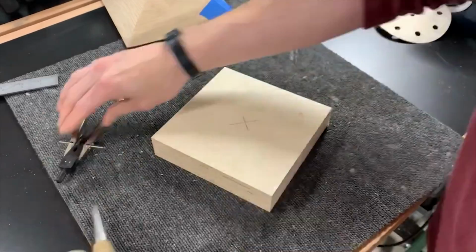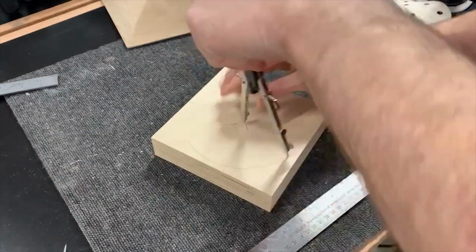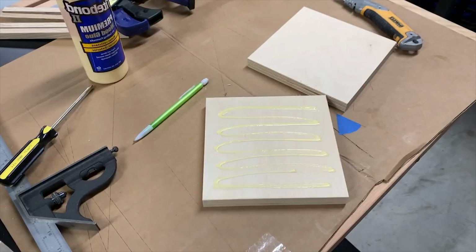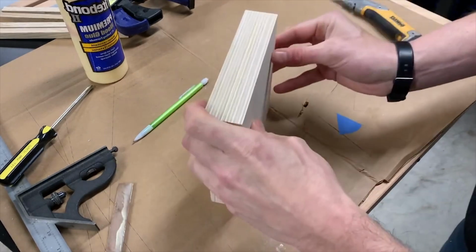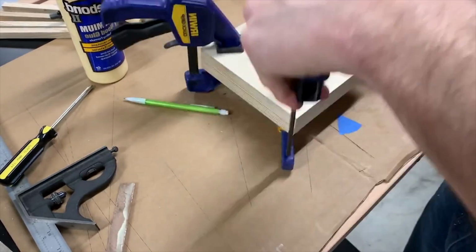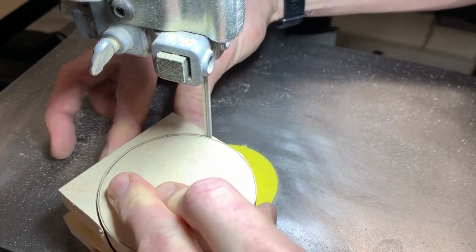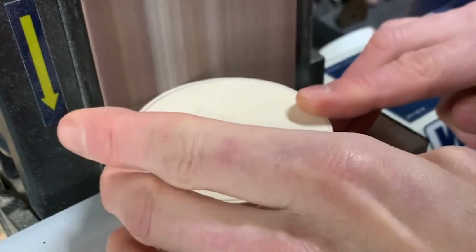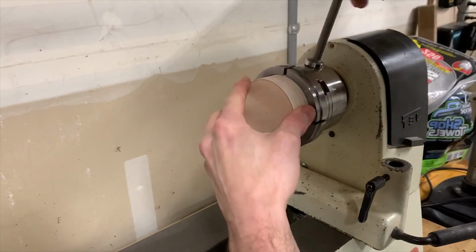To make this tool, you can use a wooden board or plywood with a thickness greater than the diameter of the bent workpiece. If you can't find a board of the suitable thickness, you can use several boards glued or screwed together. Create the contraption using a rounded template, which is then attached to a workbench or a sheet of particle board. To prevent the pipe from slipping off the wooden template during bending, make a small recess in it. You can do this using a handheld router or a regular chisel.